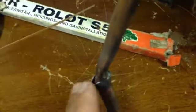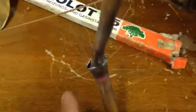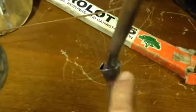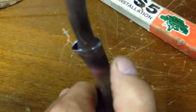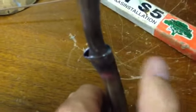In a minute what I'm going to do is heat it up and complete the job without needing to clean it, and without this solder falling out. And then if I wanted to, I could actually go and literally take another piece of copper pipe and braze it on half an inch away, there even.